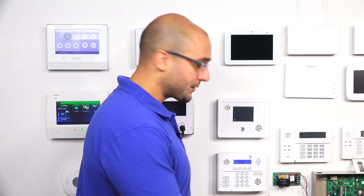Hi DIYers, Joey from Alarm Grid, and today we're going to talk about a new device from Qolsys, the 16F. What this device does is it's a hardwired to wireless converter. It allows you to land 16 hardwired devices — it has 16 zones for hardwired devices on the unit. It works with S-Line encrypted communication with a Qolsys panel, and it has some other really cool features that we're going to touch on today.